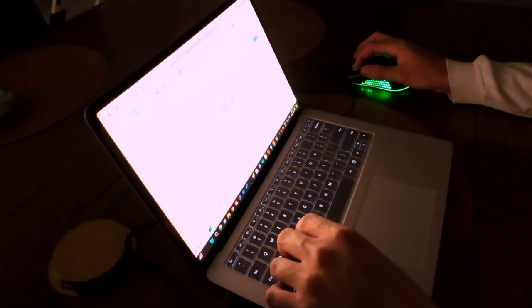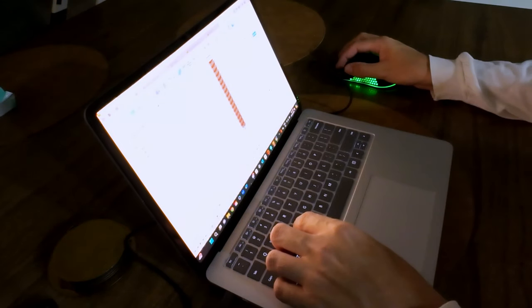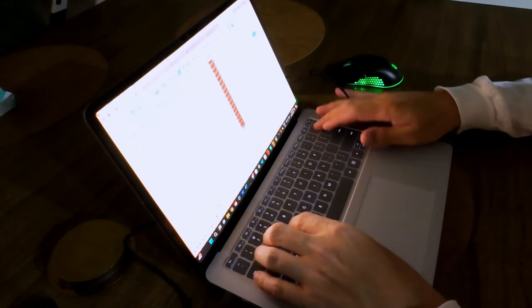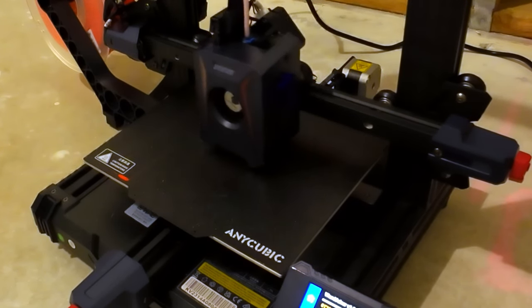So to draw that joiner piece on Fusion, I just drew a circle and then extruded it up to about the length I wanted. And because epoxy doesn't stick to plastic very well, I put a coarse thread around the outside of it. But the thread didn't really print very well because the diameter of the whole thing was like 5 mil, but at least it put some grooves there for the epoxy to stick to.